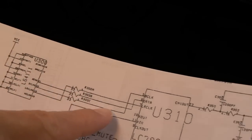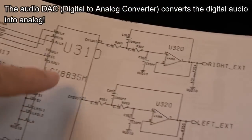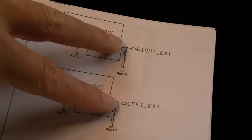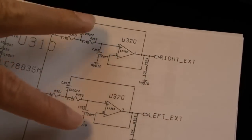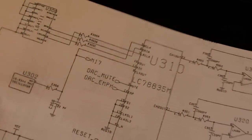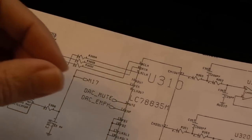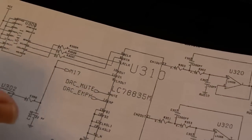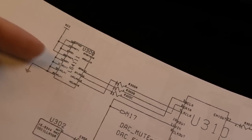The audio DAC could be the issue. Out of the audio DAC you've got left and right audio, then op-amps and your audio outputs that go to the CD32 and get mixed with the normal audio. It's very unlikely to get pops and squeaks from this section here. If you've ever had Video CD from back in the day, you'll know that if you knock the unit or there are scratches or dirt on the disc, you get pops, squeaks, clicks in the sound, and random color blocks in the video.